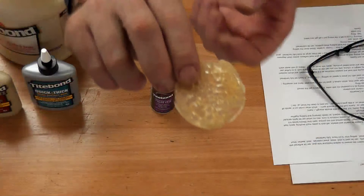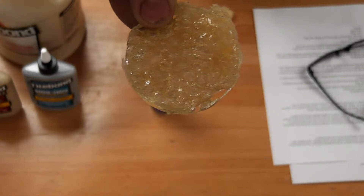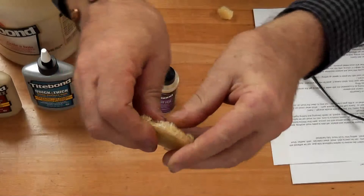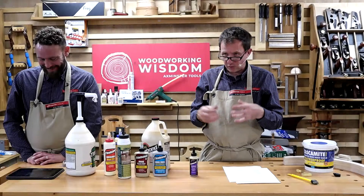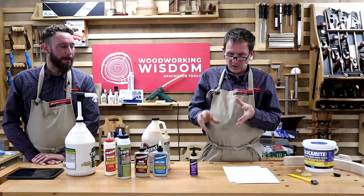Polyurethane bubbles up and creates foam when curing. The problem is lots of bubbles means not much structural strength — it bends because of all the air bubbles. However, as long as the joint fits together firmly, it has really good strength — as strong as epoxy, they reckon. It's fully waterproof, unlike PVA, so it's excellent for outdoor use. It bonds porous and non-porous materials.